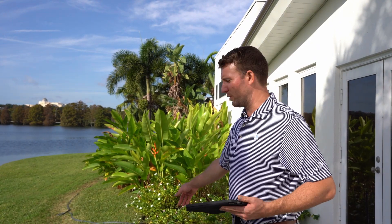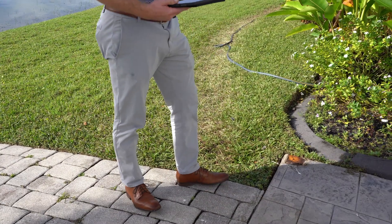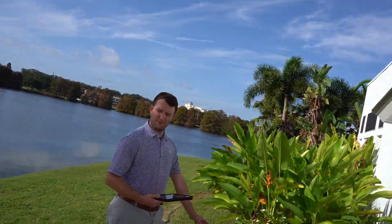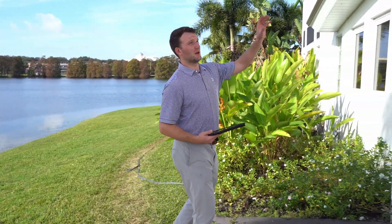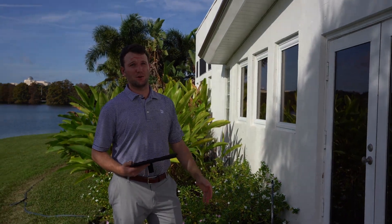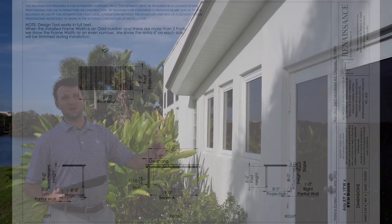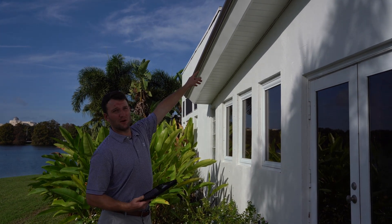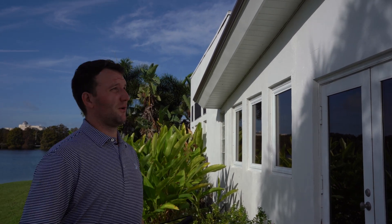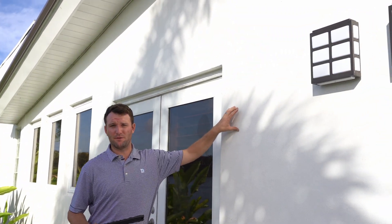In this situation the structure is going in a corner where there is an existing bracket that we have to remove. We're going to find where our first post is going and let that serve as a control point. We'll also take a look at the house wall for any obstructions or clearance issues. This is a 19-foot wide structure, so the main issues we may foresee are the screws that go in right under the eave in the corners. The layout for the trusses is straightforward — we're going right against CMU block, and we have all the correct fasteners for CMU, included in the kit.